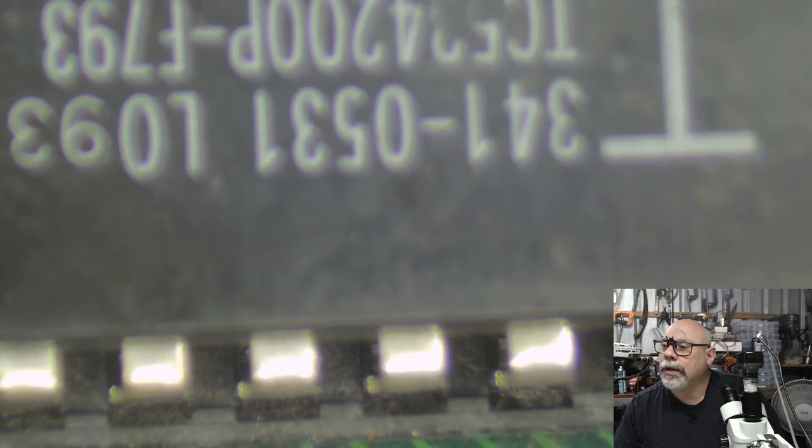Surface ceramic cap today, live on Twitch. Yeah, he said it was at 450C and he couldn't remove it. No idea what he was doing. 450C? Yeah, I have mine on 420. Doesn't take long for a ceramic to come off the board, I can tell you.